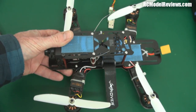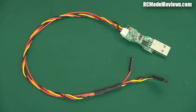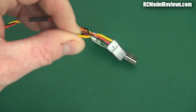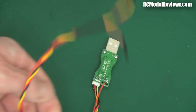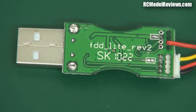To connect the board to our PC, you need an FTDI adapter. This has a USB connector on one end and on the other end a regular servo connector that plugs into those pins on our board. The one I'm using is a FrSky product — the FDD Lite version 2. I'll put a link in the description. You can also pick up FTDI adapters from eBay. They have a USB connection on one end and three or four wires on the other.